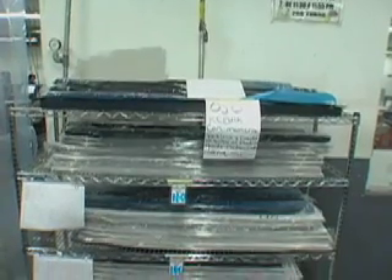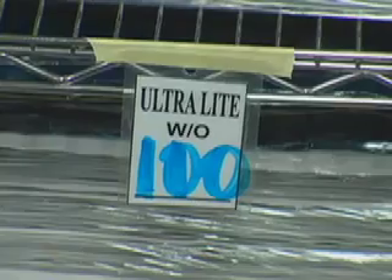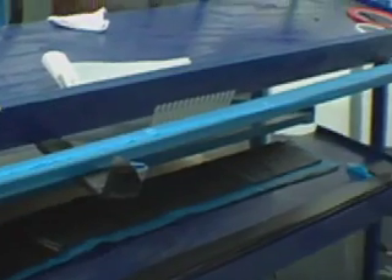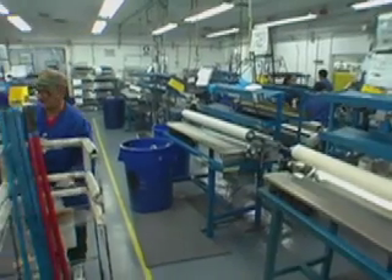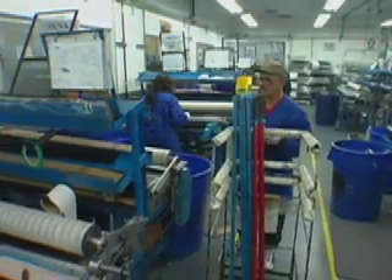The design-specific kits are kept in a temperature-controlled area until they're ready for rolling, as we call it. What you see there is actually a shaft that's ready to go to the oven and be cooked and become a semi-finished product that will be assembled and become a Stealth.